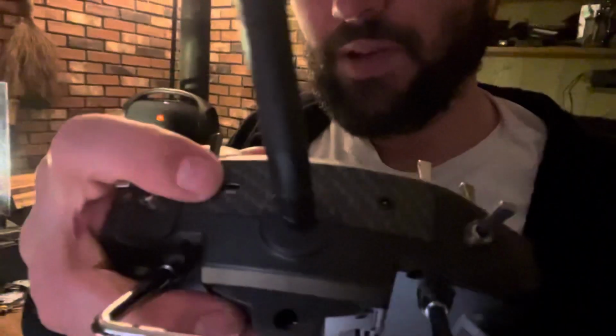Well, it's fairly inexpensive. It's a nice form factor. It does allow USB charging, which I find to be very convenient. So I can plug a USB cord into this, and it'll charge the batteries. That's nice. Also, I was able to, kind of a DIY, be super careful when you do this project, break open an older laptop power supply, and it had round cells in it. And I took the cells out and I tested them to see if they had any voltage. And I charged them on an RC charger, and they seemed okay. The capacity is okay. Some of them weren't good, some of them were.